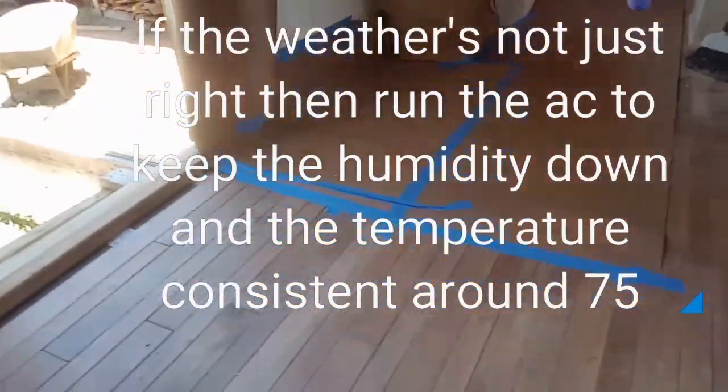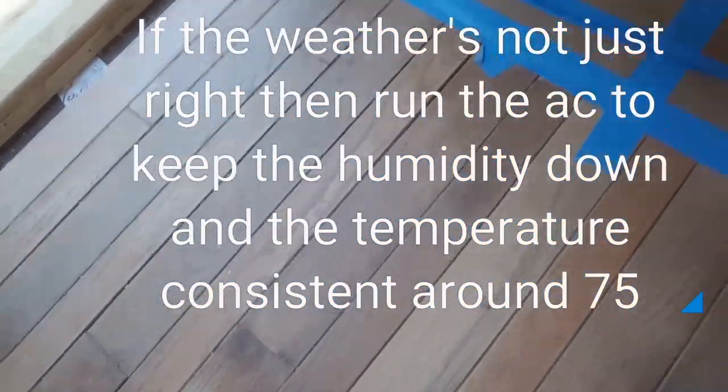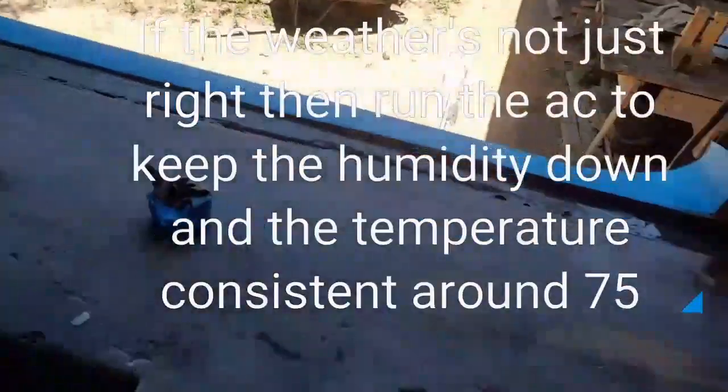All underneath here you'll notice that we've had to tape everything off, because when you drag with the blade you'll drag over the edges everywhere. If water falls off the edges of your countertop you need to be able to catch that. We build little dams with duct tape so it doesn't run off onto the hardwood floor.